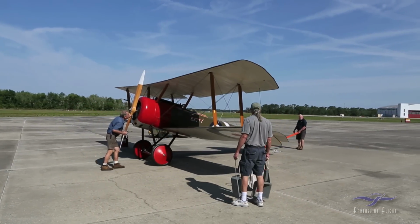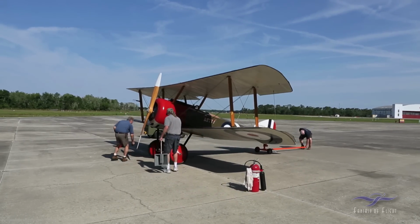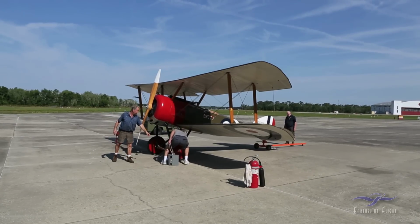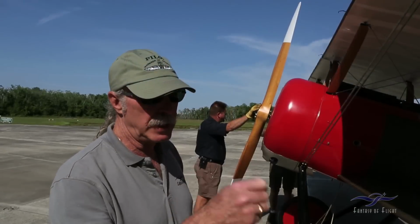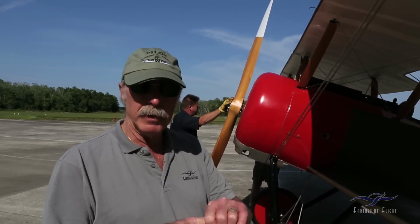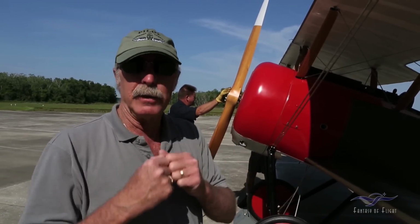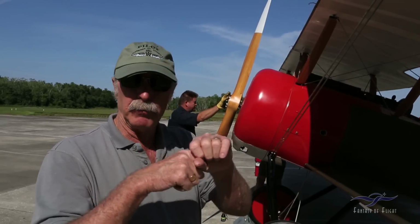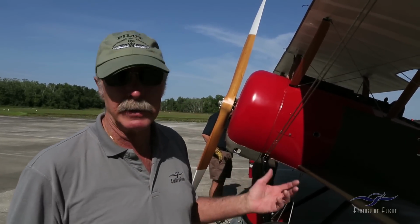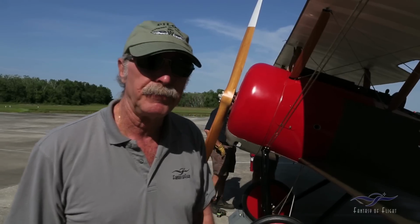There were a couple of little things that I thought were done that weren't done. Anyway, we had to wire the blip switch. We had to make a little bit of an adjustment on the quadrant for the tampier valve. And the fuel valve was basically not shutting the fuel off. So even when I would shut the tampier valve off, which was like a little tapered needle valve, and close it, it was still dripping fuel. So Andy had to take it apart and clean it out. But anyway, it's working fine now, so we'll see how it goes.